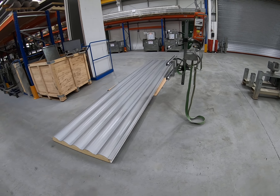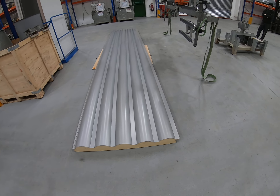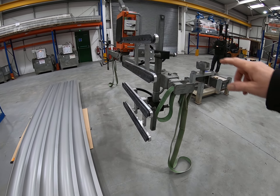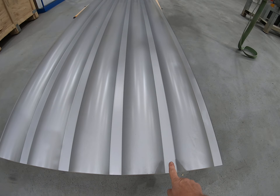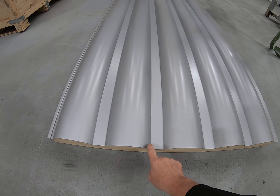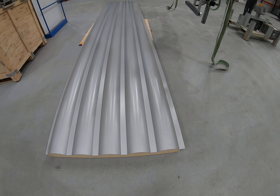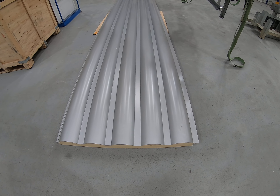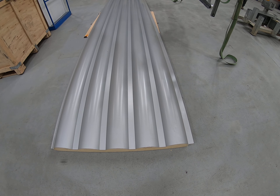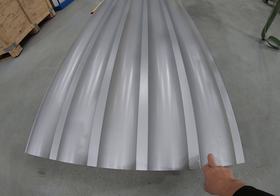Just a quick word about the panel. This is our sample curve wall panel. We've got four suction pads each side of the machine, and they're going to locate in this, this, and this groove. As we lower them, you'll see the suction pads are quite narrow — it's quite a snug fit into those valleys. Just make sure they're located carefully so you don't scratch the panel surface in any way.